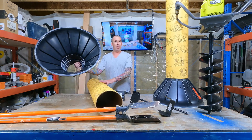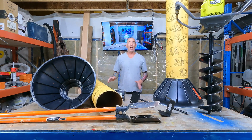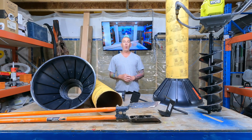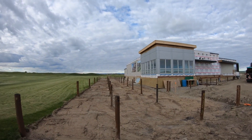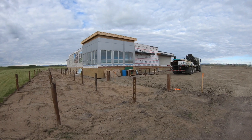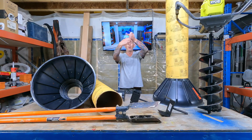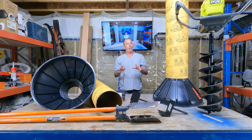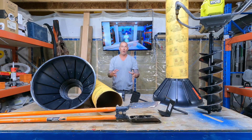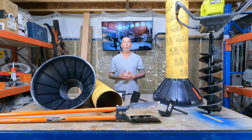This Bigfoot will give me about three times the bearing capacity. Screw piles are another option. Using a skid steer or a backhoe, metal augers — something similar to this bit — with poles on them will get screwed into the ground, getting those fins down to below that 4 to 4 foot 6 depth. Those fins will sit on undisturbed bearing soil, and that's how the screw pile works.